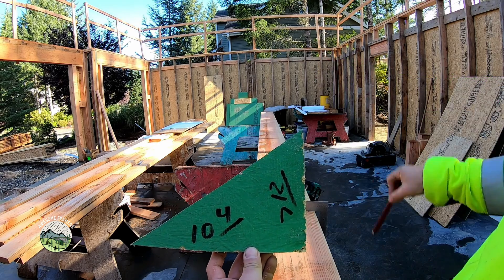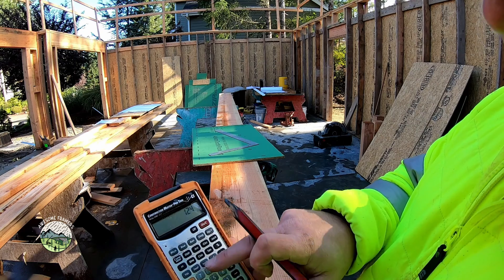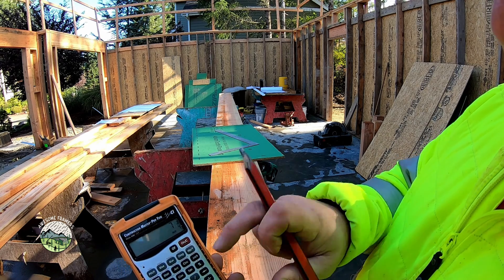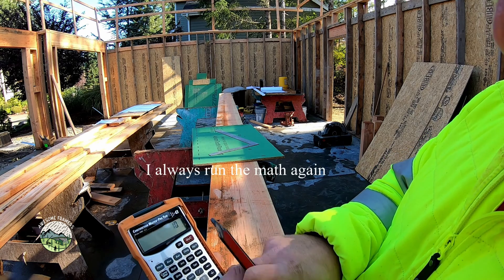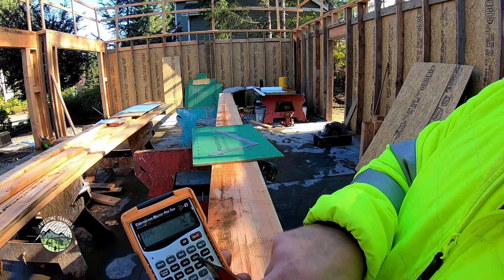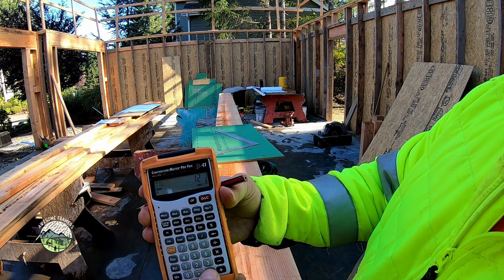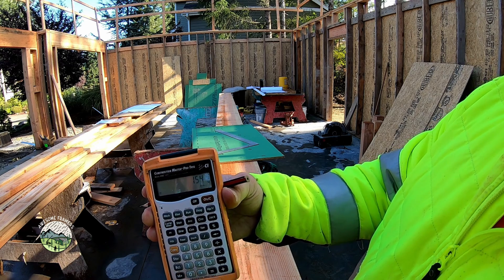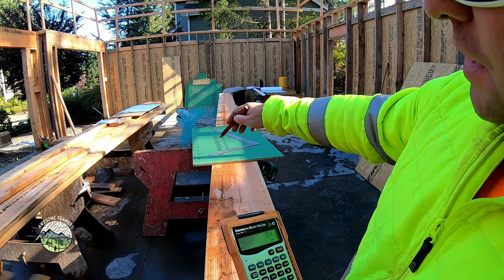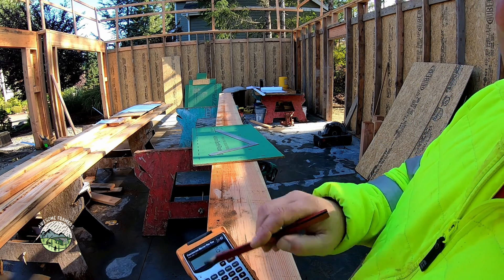I take the line with the blade to account for pencil thickness when I go to mark. With 124 inches and 16 rises, I enter the rise and 10 and a quarter as the run — diagonal is 12 and 7/8. I'm going to store that now. When I add using recall M+, it takes into account all of the rounding and any accumulated error. I'm going to cut a pitch block with my rise and run and center that between all of the marks the calculator gives me.